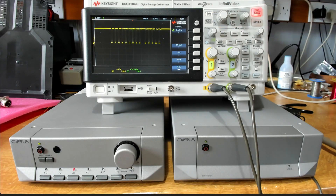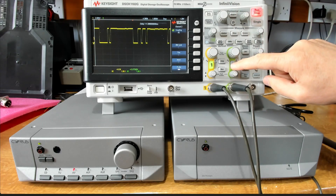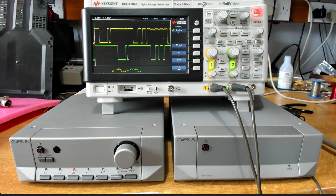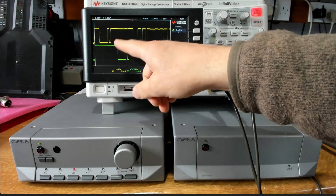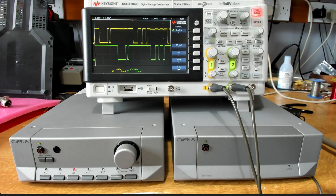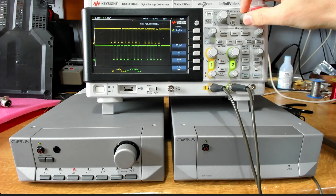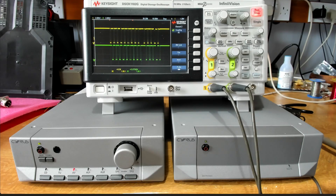It's quite a complex arrangement simply to turn this thing on. If we turn on channel 2 of the scope — looking at MC bus out — we see an echo: the data we're sending in comes out 10 bits later and ripples through the system. If the controller doesn't see the echo, it stops at the first command and nothing happens. So we need this complete system to make it effective — quite involved, and a discrete 12-volt trigger line is going to do absolutely nothing for us here.